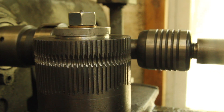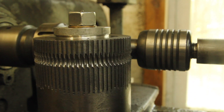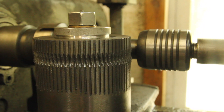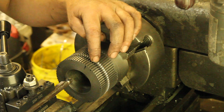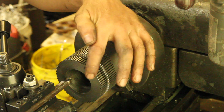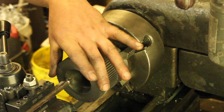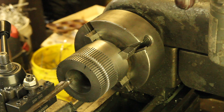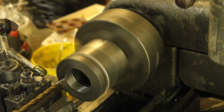This will be 5 thousandths off the radius. There should be enough material outside of the worm gear that I can make the nut to retain the table in the base. Before I cut the gear off I'm going to go ahead and do that while I have a good way to hold it here. This is just one of those things where thinking through the order of operations is going to make things easier later. I'm going to bore this, thread it, cut it to size, part it off, and then part off the worm gear.